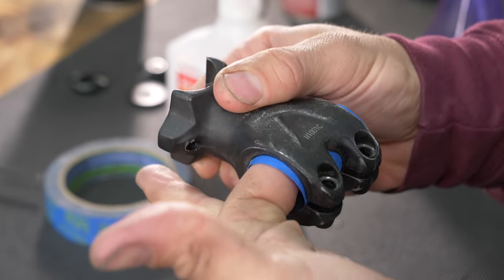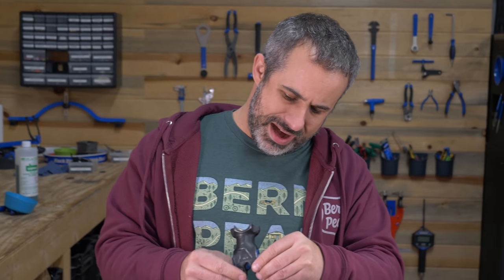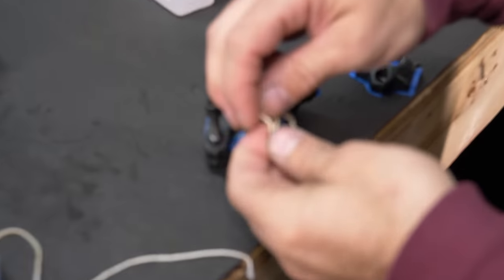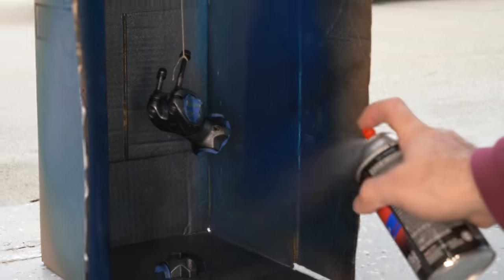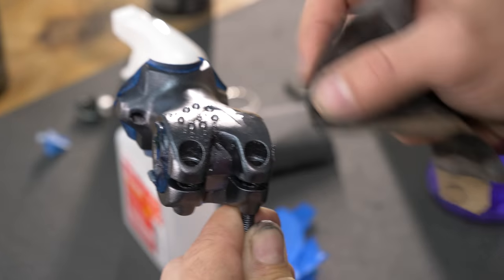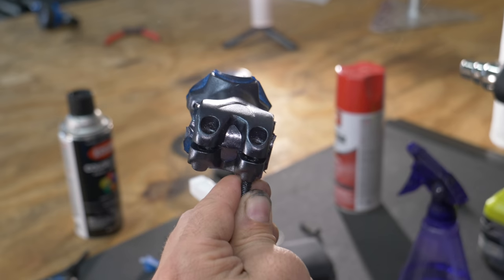We're going to take some masking tape and try our best to tape the inside. Good use for rusty bolts — I'll just stick them in there so we can't get any paint in the threads. We have these bolts sticking out, so we can tie a string here and suspend it in the air when we're painting — now we can paint all sides of it. Oh look, a drip. We got a drip because I suck. The great thing about learning from a complete beginner is I can show you how to fix your screw-ups, which are definitely going to happen. We're going to sand down until it's smooth — you're still going to see it, but you're not going to feel it. If you run your finger over it and you can't feel it, you've sanded it down thoroughly enough.